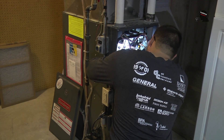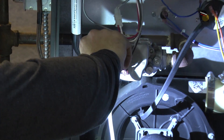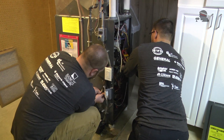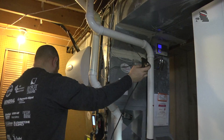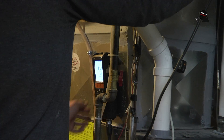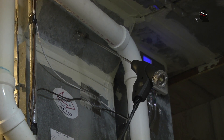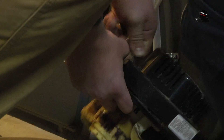Finally, once we have all the safeties checked, we'll turn the unit on and check to see if there's any leaks in the heat exchanger — a result of that would be the dreaded carbon monoxide, the silent killer as it's known, and it's really easily detected. We have special equipment where we can detect any carbon monoxide. We put it in the combustion exhaust, which normally has carbon monoxide as a byproduct of combustion, and it was at very low levels, so even if there was a leak, it would be unlikely to hurt anybody.